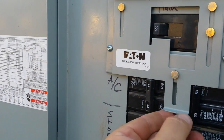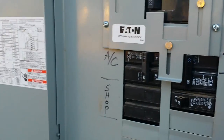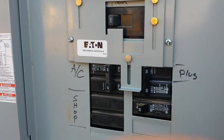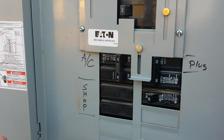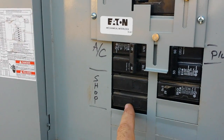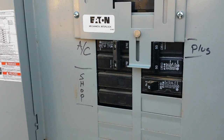In order to turn the main back on, you'd flip the generator breaker off, let this fall down, and then you can flip the main back on. So it never energizes beyond your box. This is probably the easiest and cheapest way to install without doing one of those other transfer panels. You just control your power in the house — don't flip on your microwave when the dryer is running or turn on all the lights. Run only what you need. There's no picking and choosing individual breakers — you just flip these two and your refrigerators and freezers are back on. She also has refrigerators out in the shop, so it'll feed the shop from here and turn those freezers and refrigerators back on as well.